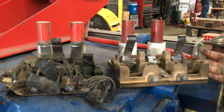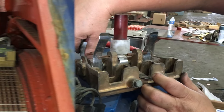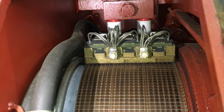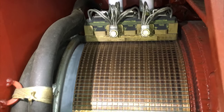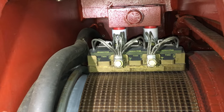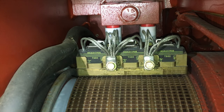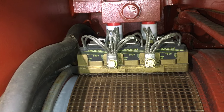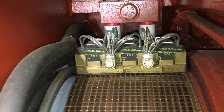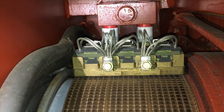Something like a rotary table motor. The Teflon insulators must remain clean. This is a remanufactured motor — the commutator has been resurfaced, everything's been done. It's got the new holders and the new carbon brushes. You always want to try to maintain a 1/8 inch gap between the commutator and the brush holder — maximum 1/8, minimum 1/16 of an inch. That keeps the brushes from chattering and chipping and breaking over time.